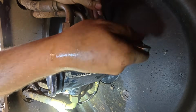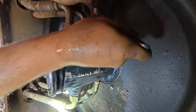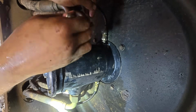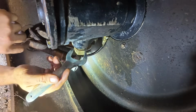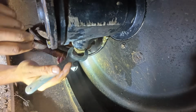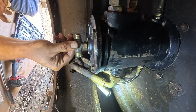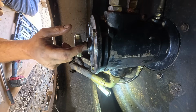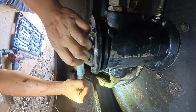These are hydraulic line wrenches. They're thin and they're good for getting in tight spots. When you tighten these, you want to make sure too that they're not rubbing on anything, because you might need to twist the fitting a little bit. Pretty much this you can orient any way you need to. There's an O-ring that you smash up against the housing with this nut and washer.